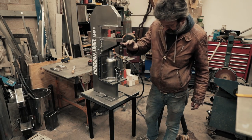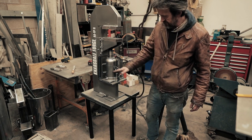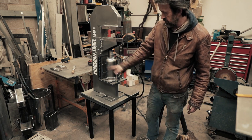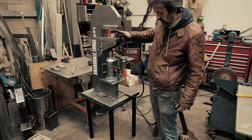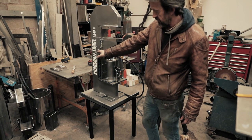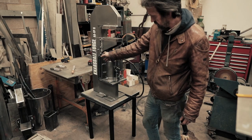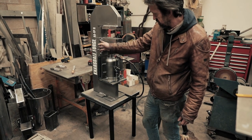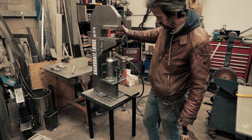That's it all back together again. This morning I've welded up a stand for it - lower than my other bench just to give me a nice working height when I'm forging. I also forgot to add the grease nipples, so I've added one each side of this carriage. I may need to add one in the center but we'll see how we go - if I'm getting an even spread of grease then it'll be fine.